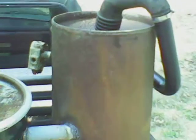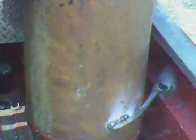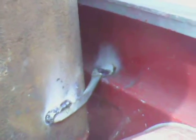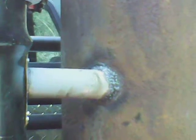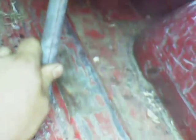My new cyclone — as you can see, the gas comes out of the gasifier, goes into the side of the cyclone, spins around, goes down through here all the way to the bottom. Down in here there's a drain plug where you can pull it out and drain the liquid. I have it anchored to the bed right there, and the other anchor point is the two-inch pipe. I was thinking of taking that other piece and maybe putting it up like this — I'll figure that out, that's probably what I'll do.